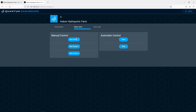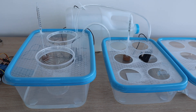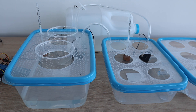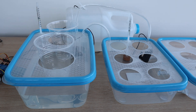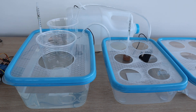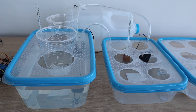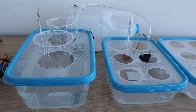If we now run the automated flood cycle, this is what we get. After a lot of trial and error I couldn't get the float switches to operate reliably. There wasn't enough space in the small syringes to put a large magnet, and the small magnets only triggered the reed switch when they were in a particular orientation. This worked 90% of the time, but on the odd occasion when the switch didn't close properly it either flooded my desk or left one pump running dry.